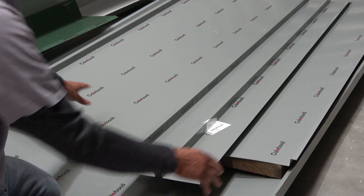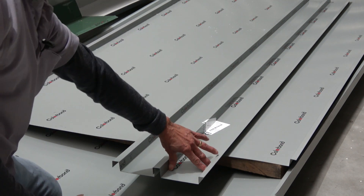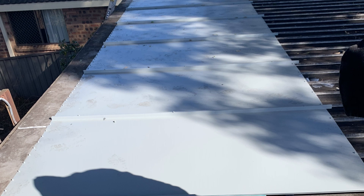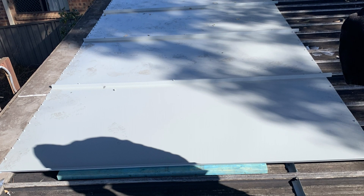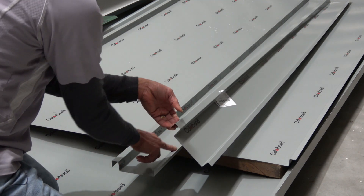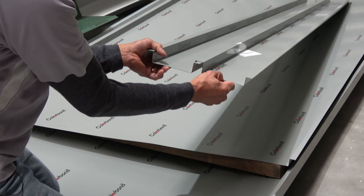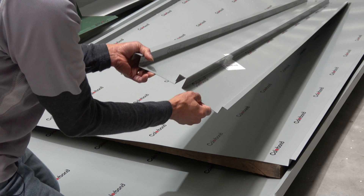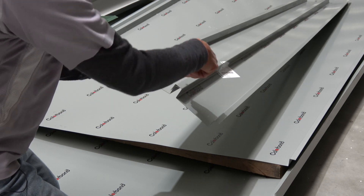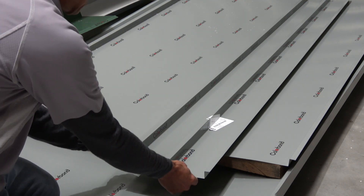In this instance, you've got one that's quite wide — it goes all the way across, it's over a meter wide. This one's only about a hundred wide. If you've got a super wide tray flashing, you don't need to have a screwed and silicone joint every time you've got a lap, because you're introducing a standing seam which is the lap. All you need to do is this goes over the top — it's got a little bit of play — and we can have a screw on the side or a screw up the top, and the job's done.